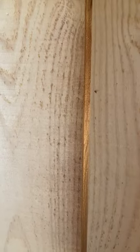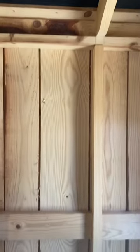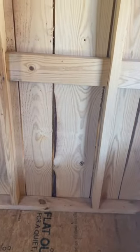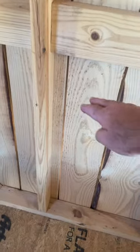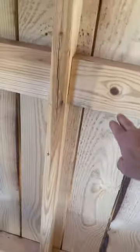You've got an average of about a half inch shrink rate, no matter how wide the boards are, which is fine. You can see there's a little light sneaking through that batten. In an eight-foot wall, I just simply used one block between them. The best thing to do would be to split the wall up into thirds at least, so your battens have more to attach and pull down and hold your siding boards.